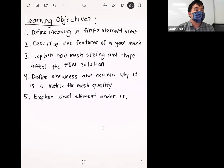So can we assume the compression force that we calculated with the yield strength is the same amount for torsional as well? I wouldn't go that far because every direction is going to be a little bit different. When you do bending and put the force in the y direction, you get a maximum load of like 125, 126. But in compression, you can load it a lot more because that's a different direction of loading. So torsion would give a different value. But not torsion, tension. Compression and then tension is just the opposite side in the x direction instead of negative x.